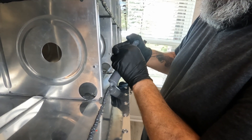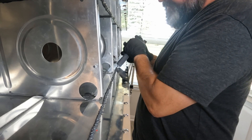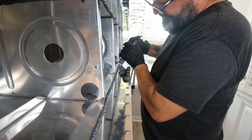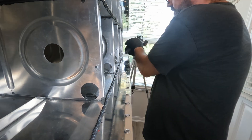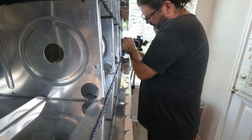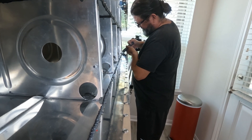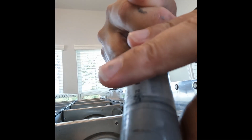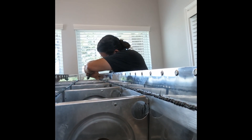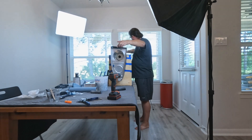You can see it's the bottom of the rib flange — that cut-out gap needs to be left free so that fuel can flow at the very back of the tank, which would be the lowest point, down toward the quick drain. So I'm being very careful to keep that bead of sealant just inside of the rivet line. When the baffle gets dropped in it'll sort of squeegee and push it into place without obstructing that flow path. I don't know how you could do this without a syringe or a Semco applicator — these syringes worked out great, maybe two dollars and 35 cents apiece.